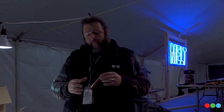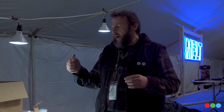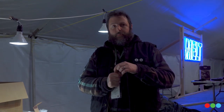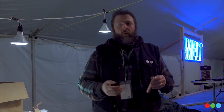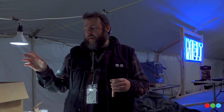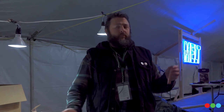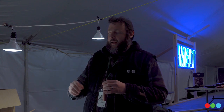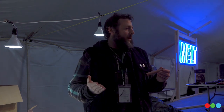And so that black film you get on these bars, it can foul your solution in the way of, if you let it get really, really thick and then you start banging stuff around, you'll see it start flaking off. Well, what I've discovered is if I maintain this on a daily basis, where I'll run it for like 12, 14, 15 hours, but then ultimately at the end of the day, I remove the bars from the bath, I remove the marble from the bath, then it's not accumulated so much that it wants to flake off yet.